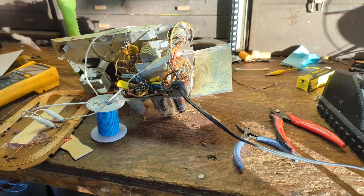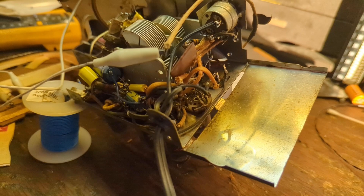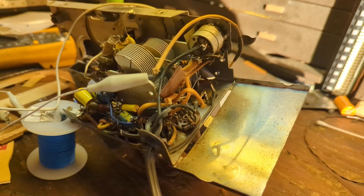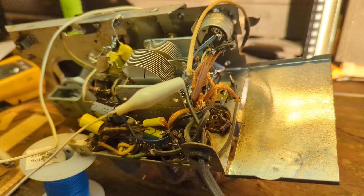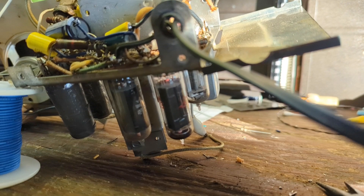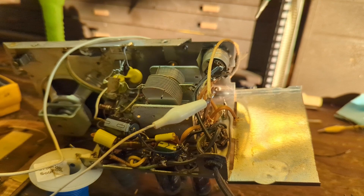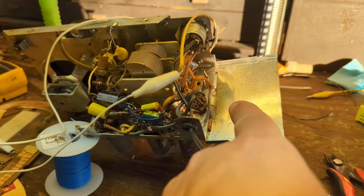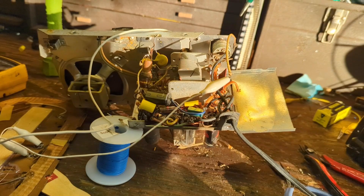Usually the first connection off the IF can disconnects the radio signal really cleanly. But I found that instead, the last pin on the 12AV6 — or 12AT6, one of those — truly disconnects the IF signal. It took me about 30 minutes to figure that out. I could have stopped being lazy and printed a schematic, but that'd be too easy. I've got this clipped out and a switch will go in here between these two. If I ever see one of these again, I'll pass it up — you have to flay out the entire chassis just to get at it.